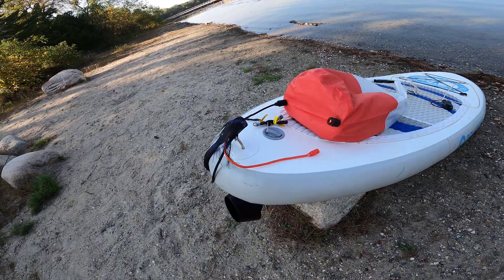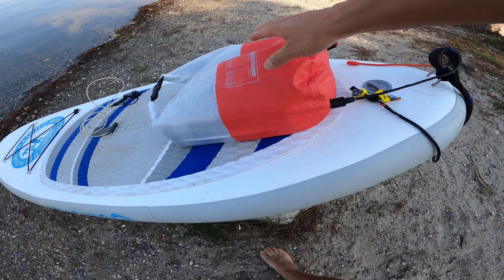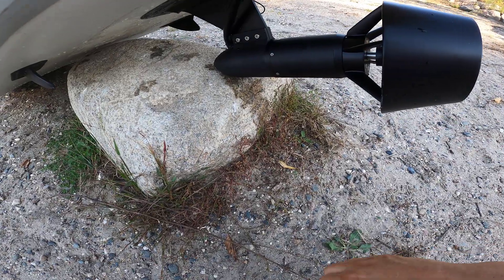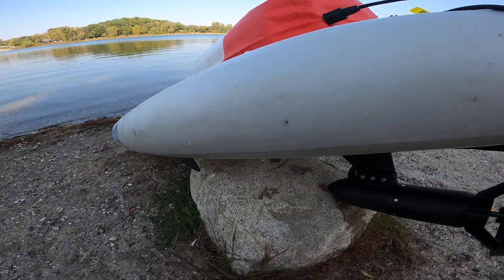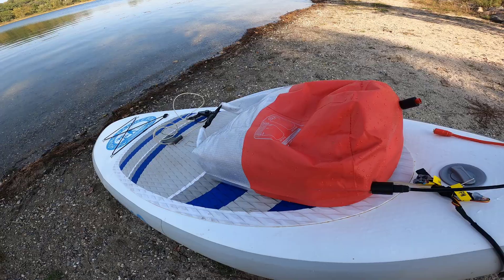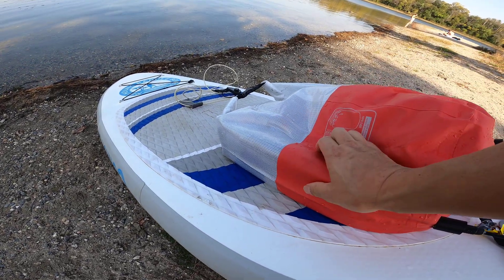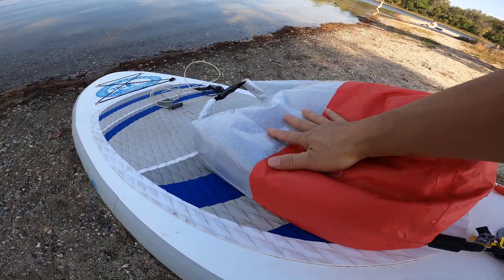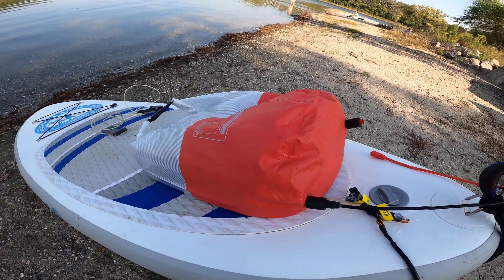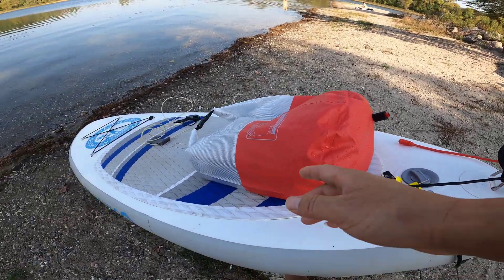For any electric water sport build — whether it's a surfboard or foil — the battery is the major challenge. It's easy to waterproof your motor and your ESC, but it's not easy to waterproof your battery because there are too many cells. If you do a 10S battery, each pack is a 10S 3P, which means 30 cells inside, and I have six of them — that's 180 battery cells inside. That's a lot of work to waterproof. So I use a waterproof bag — it's much simpler, and it floats, so you'll never lose your battery.